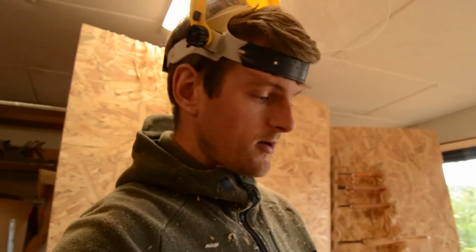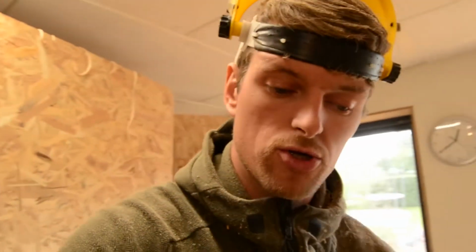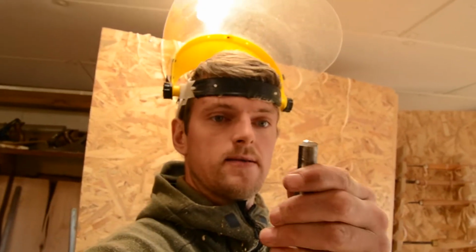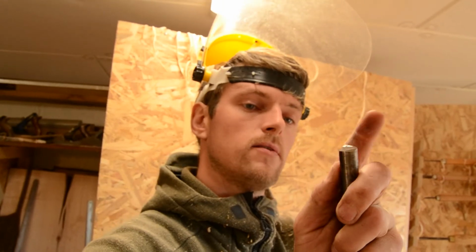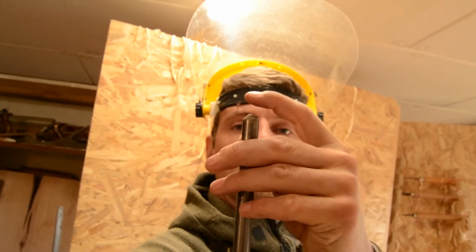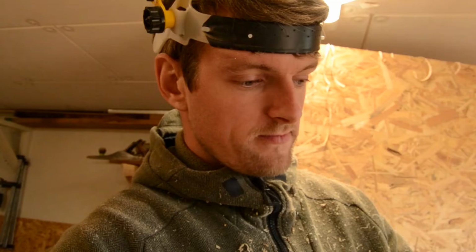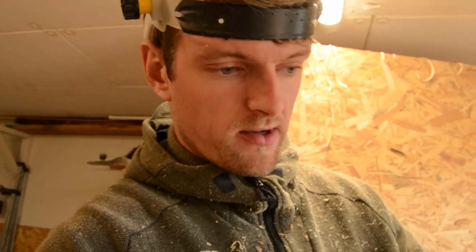Okay, so I've turned to my bottom bowl gouge, which is definitely not ground with the 40/40. This is ground at about 55 or 60 degrees bevel and only about 5 degrees wing angle. I'm going for the bottom of the plate-bowl thingy here.